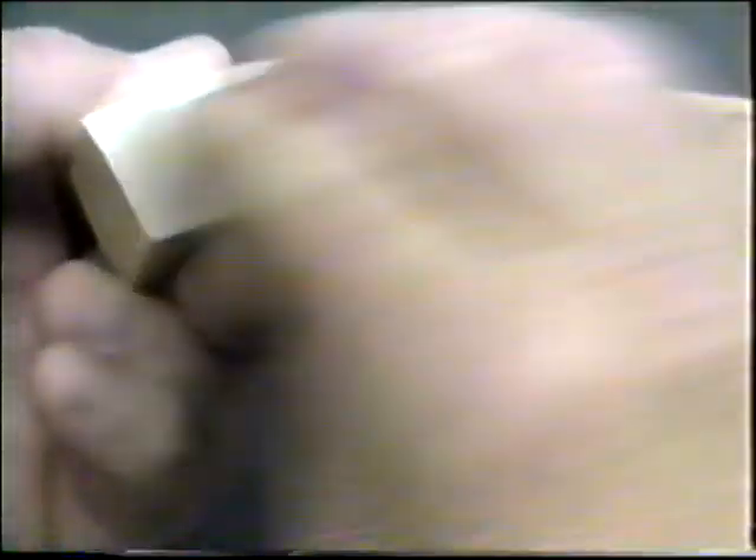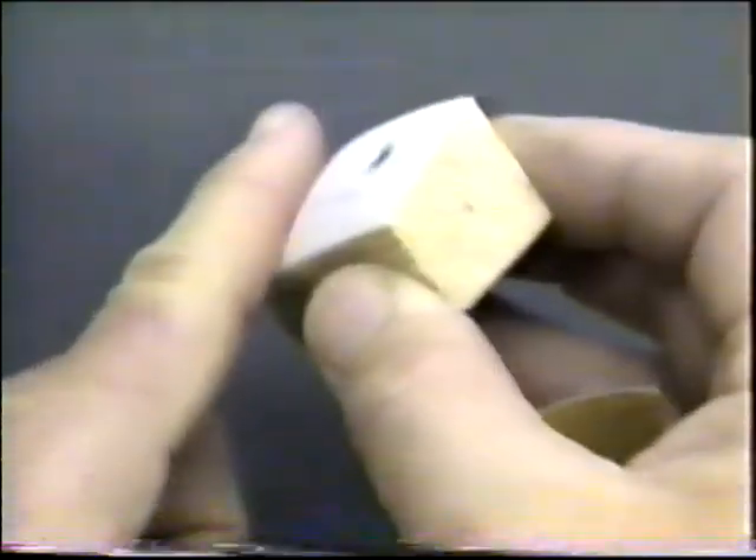First thing, I always want to do a test. I have two real thin coats and one that I just slopped on here, so there's really three coats of clear on here already. Give it a day or so between coats. If you're in a rush, put it up by a heating vent, but I suggest it's a lot better to dry at normal dry time rather than try to force dry it. What I'm looking for, before I go any further, is powder. As soon as you see powder, you know you're not going to have a problem sanding this out.